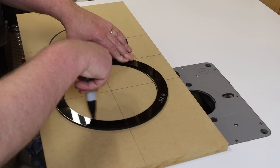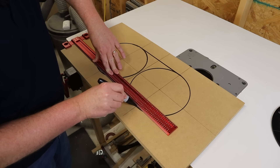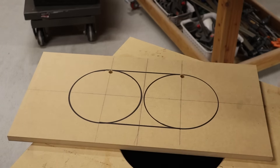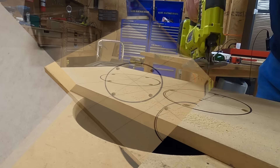To make the speaker cutouts, I made some rings with my laser. The goal here is to make a single oval-shaped recess in the outer baffle. You can do this by marking out two circles and then joining them with some straight lines. I found that a thick Sharpie works great for this process. The idea is to rough cut with a jigsaw and then use templates to trim out the shapes. When you use a pencil, you tend to go over the line or not get close enough. But if you use a thick Sharpie, you just cut on the inside edge of that thick line.